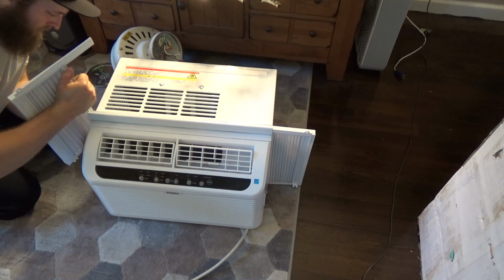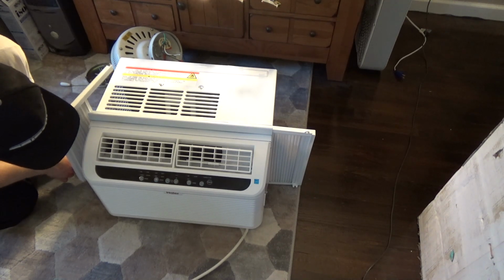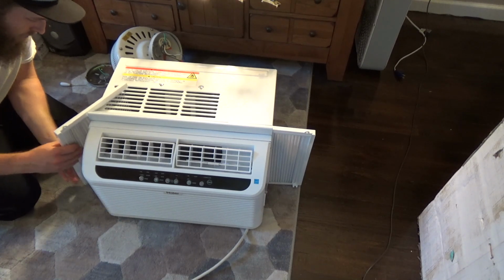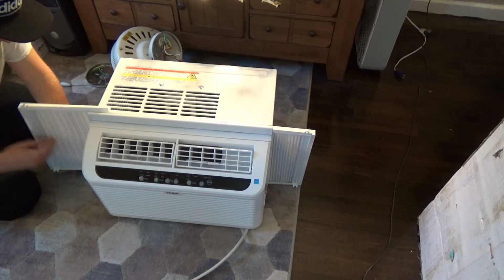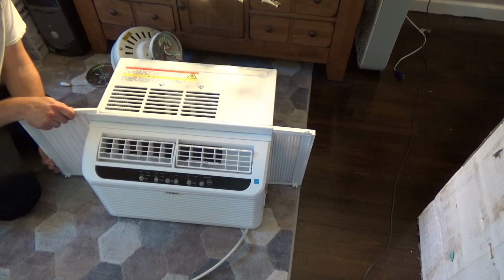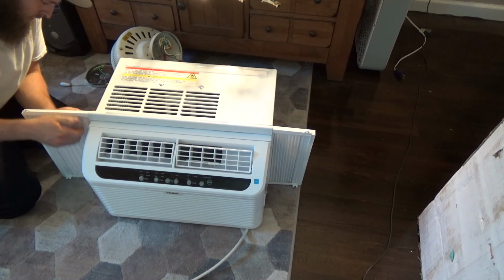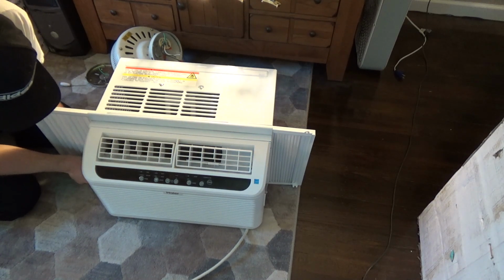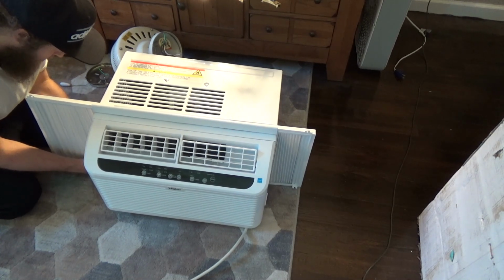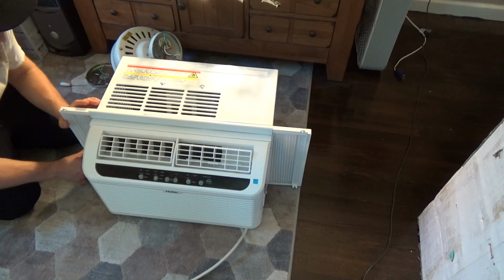Actually, speaking of Friedrich Chill, that should make a nice teardown and cleaning video. Yeah, that's another one I want to get to at some point. I thought about trying to rig that up in the studio window, because it does get hot down there. That's a very good unit until the fan bearings go out, like mine did. Well, that one, surprisingly, the bearings seem to be okay still. And if the bearings go, they are a standard size. I know because I changed them in mine. What are they, 608? They might be, actually. I think they're 608 double Z. Sorry, I pronounced it incorrectly.